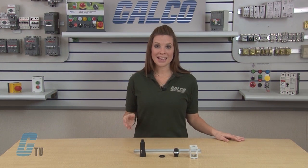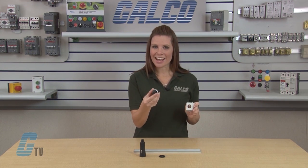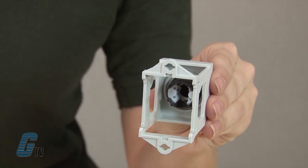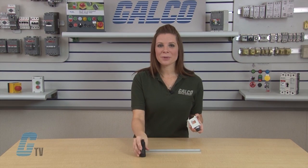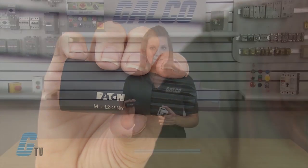During this time, the application could be in a test mode, maintenance mode, or tool change operation. To mount the M22 switch, place the unfastened M22 switch in the opening here and then tighten the fastener. Sold separately is an M22 installation tool that makes it much easier to tighten or loosen the fastener.